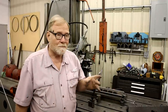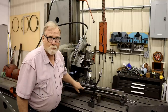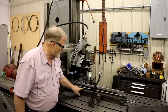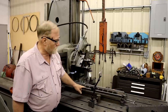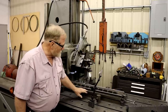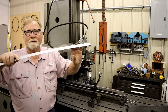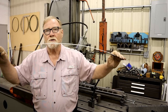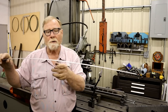Now, the second thing I've read on the internet was, why are you doing this inside lip of the dovetail? This is a side that was bent. Yes, this was bowed with both ends drooping like this, 8/1000ths of an inch. And it's because the T-slots are peened under the bottom.